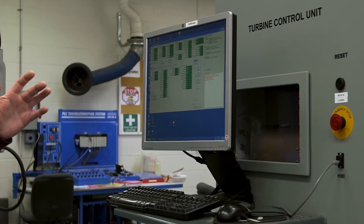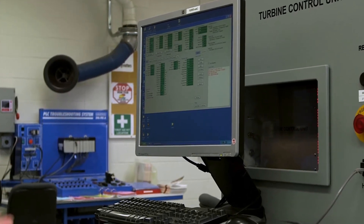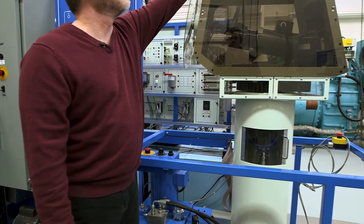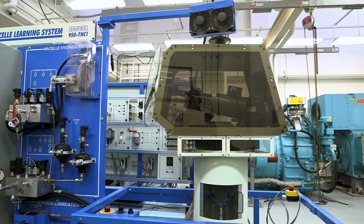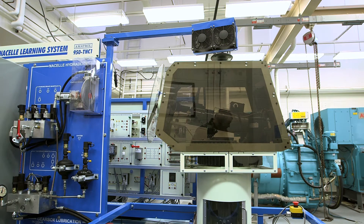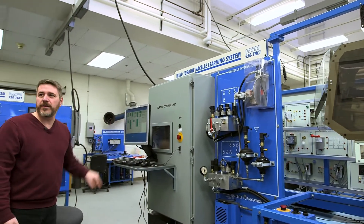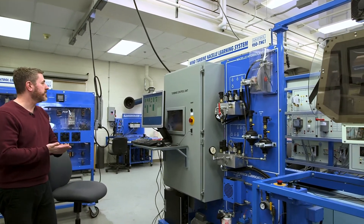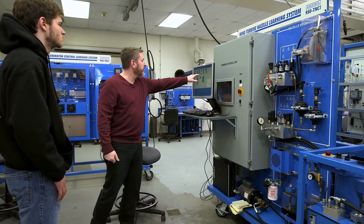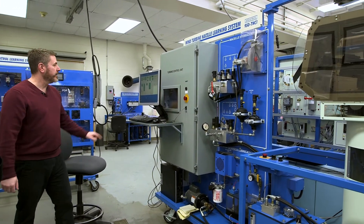You also get fault codes. Here we have a safety loop — the safety loop covers critical things like emergency stops. What we have here is a fan blowing some wind on our anemometer wind vane. The anemometer on top is reading wind speed and wind direction, and right now it's giving us an output of 16 meters per second.